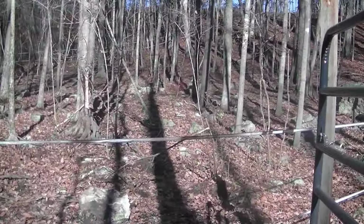Alright, and then we're going to put it into place. This stuff is very sticky, so you want to get it nice and lined up before you actually press it down. Again, make sure that your pattern is lined up the way you want. I usually stand it on end up against the other tile to make sure you have a good seam. Make sure there's nothing underneath that's going to block me. And always make sure your floor is nice and clean. And I'll start from there and then just slide it down in. See what I mean?